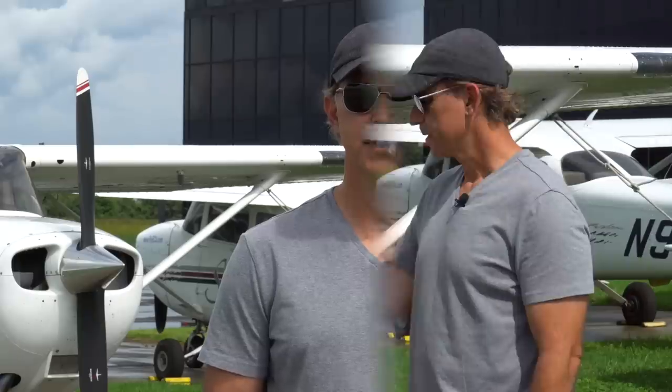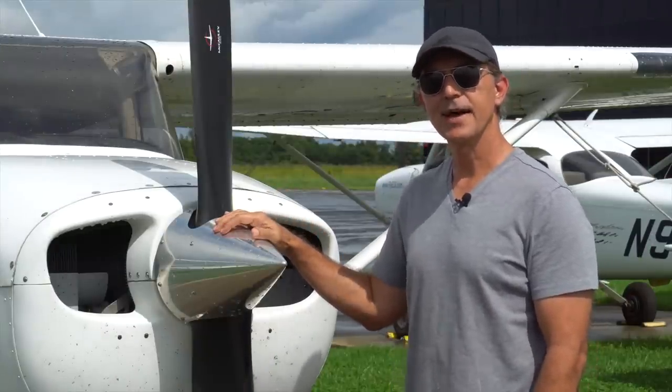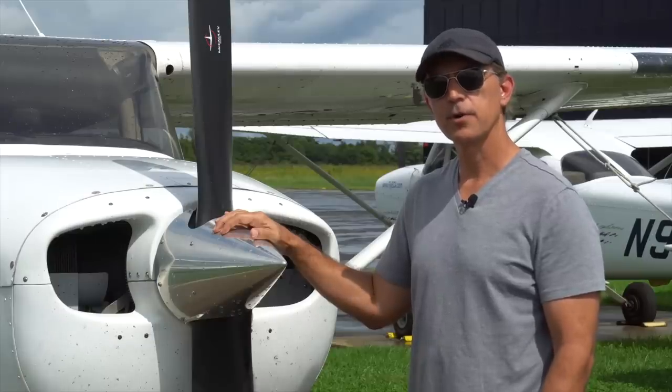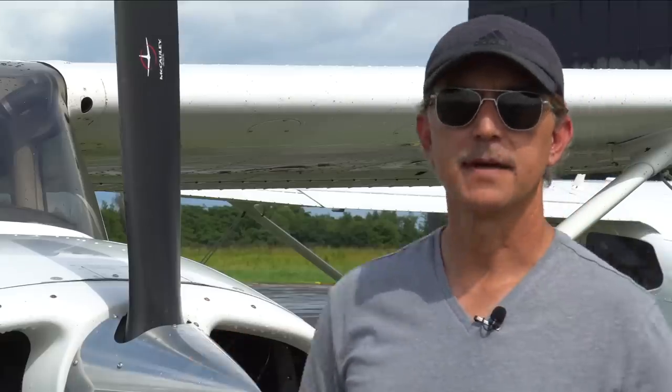Some of your top questions were: what happened to the engine, why didn't Kim use the carb heat, and should they have done the impossible turn? Before we can talk about what happened, let's first talk about what engine we're dealing with. The Cessna 172 has a Lycoming IO-360 — it is a fuel-injected, horizontally opposed, naturally aspirated, air and oil cooled, 160 horsepower, four-stroke engine.